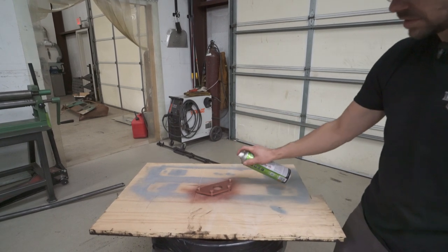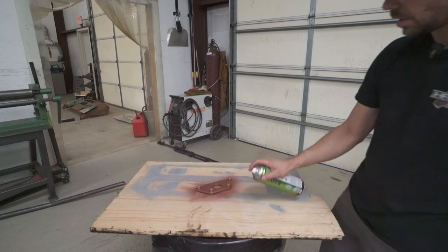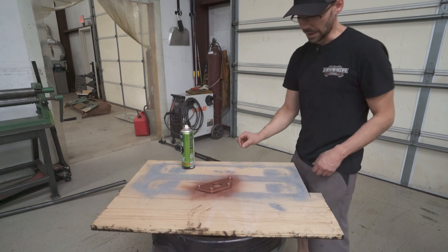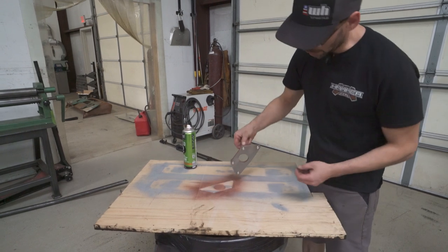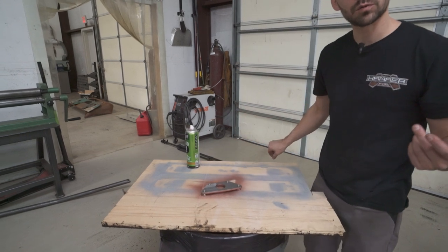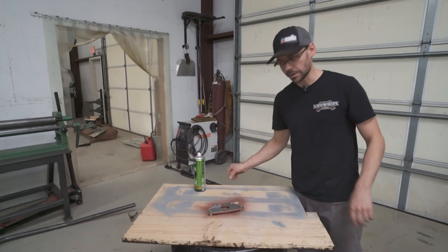This particular copper-rich primer is best suited for TIG welding but will also work for MIG welding — you just don't want to use zinc-type paint for TIG welding. Once that side's done, you don't have to wait for it to dry — just grab it by a bolt and let it drop onto the bolt heads. You don't have to worry about messing up the paint job on the other side.